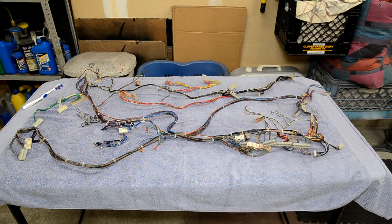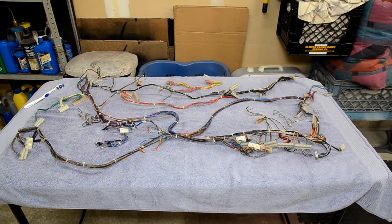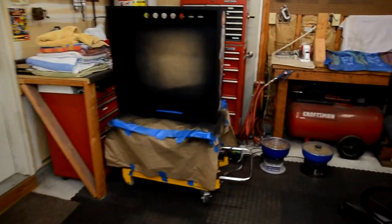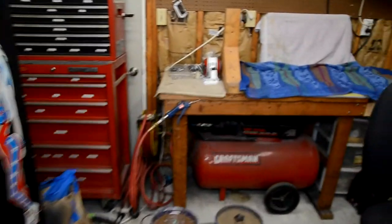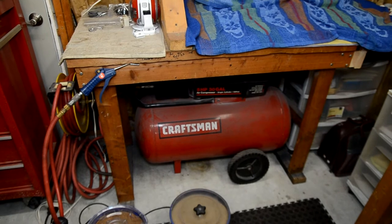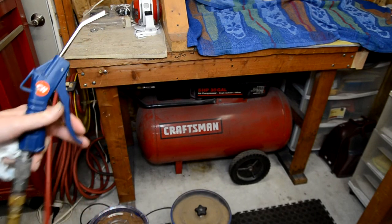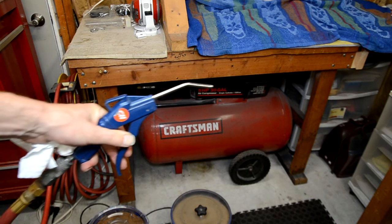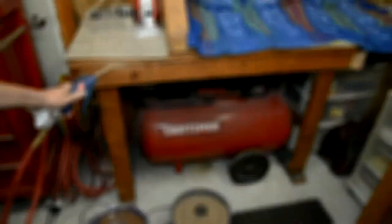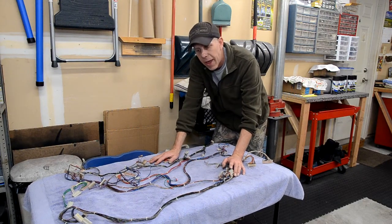You're also going to need some way to blow out the water from the connectors when you get these parts out of the dishwasher, as they're going to be pretty wet. I would highly suggest blowing as much water off as you can and then hanging them to air dry. For me, I have a Craftsman 30-gallon five-horsepower compressor and one of these cheap blow guns that plugs into my airline — I'll use that to blow out as much water off the connectors and harnesses as I can.